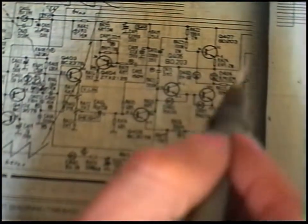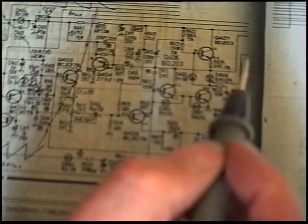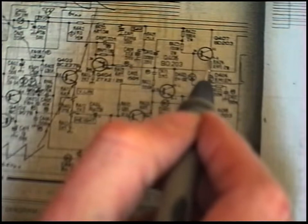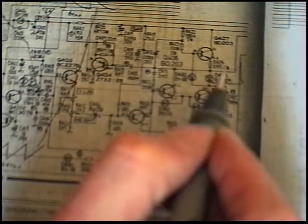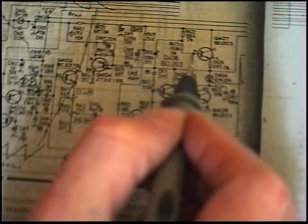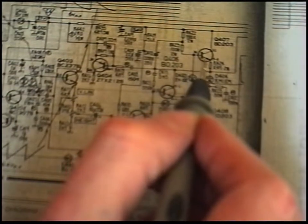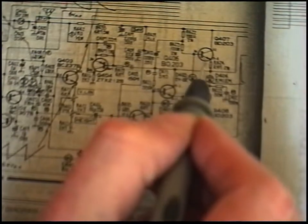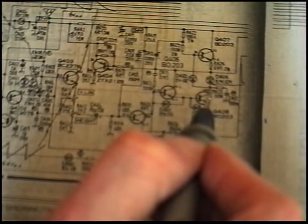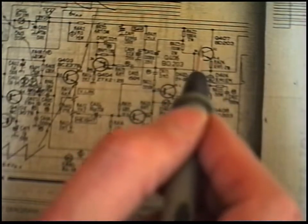And what it's doing, like I said, is similar to an output stage in an audio amp. You've got this output transistor here, it's an emitter follower, and this diode is biasing it on. So you've got one diode drop to account for this base emitter drop in this transistor, and another one to account for this diode here, so that you're biasing that to be just on.